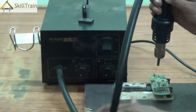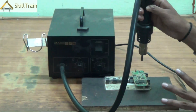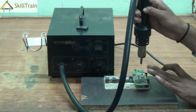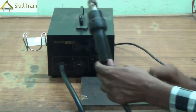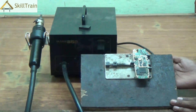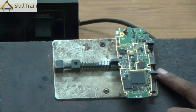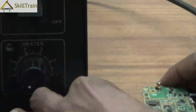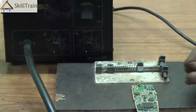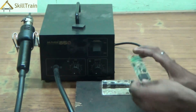While using the SMD, ensure there are no materials nearby that could melt or be affected by the hot air. Also ensure the hot air is directed at the right component and not at any other component, as this can spoil the PCB and impact surrounding components. You must also remember that the PCB should be placed on a stand while working with the SMD, as the stand holds the PCB tightly so it does not move — movement can result in misalignment of components.